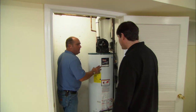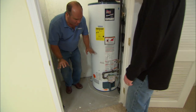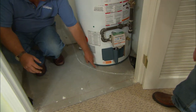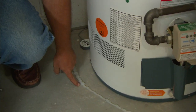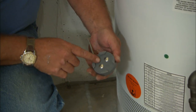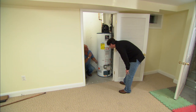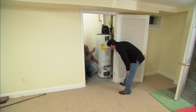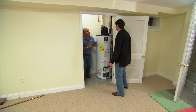Pretty quiet — very quiet. Alright, so you're going to have clean hot water. You're also going to have a dry basement because I put a bead of caulking right here. If any water came out of this water heater it would collect inside of the bead. Now the automatic shutoff valve has this sensor down here — there are two sensor ports right here. If moisture came between those ports it would make the contact, shut off that shutoff valve so no more water would come in, and give you an alarm contact.